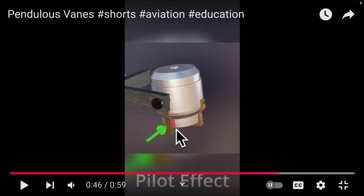Now when you place an external force on a gyroscope, you get something called gyroscopic precession. Now as you uncover this little port, it creates an external force due to the air rushing out in the direction of this green arrow. The force that is applied to the gyroscope — specifically the angular momentum of the gyroscope — will be 90 degrees to this due to something called the right-hand rule. And as a result, the gyroscope will be tilted forward based on this application of a side force.